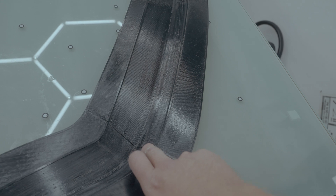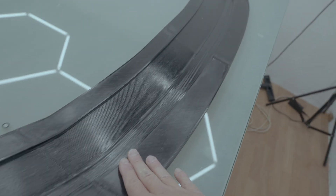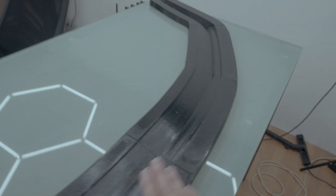The plan is to lay the carbon straight into the 3D-printed mold. For a one-time occasion, I believe that should be good enough, as I'm going to topcoat the part anyway after the molding. But before getting started, I'm going to prep the mold first. I'll lay some filleting wax into all these gaps, and then use wax and PVA for a proper release from the mold.